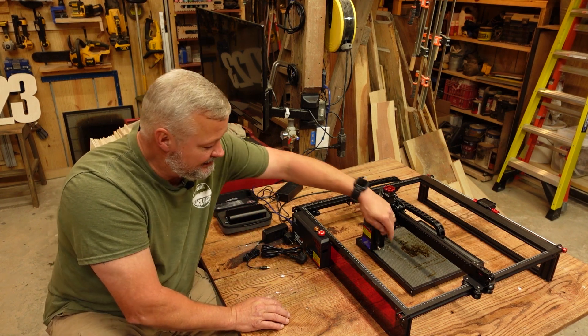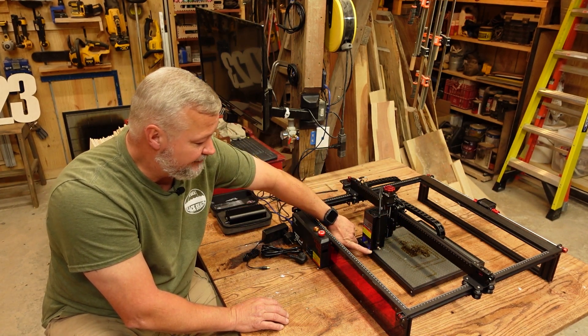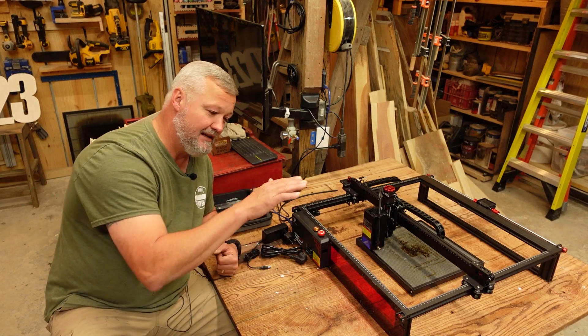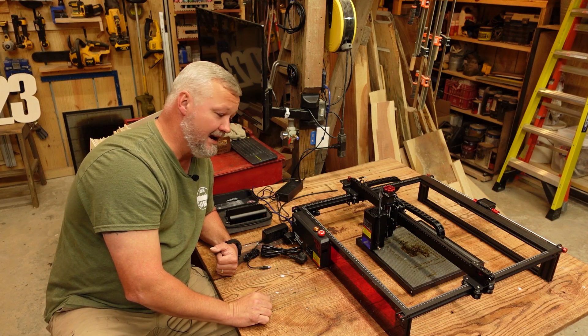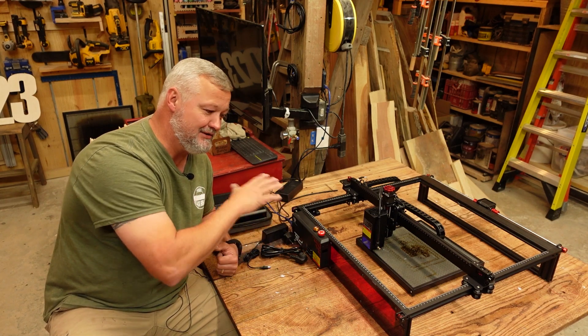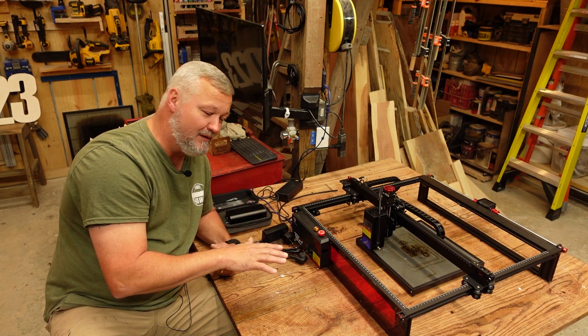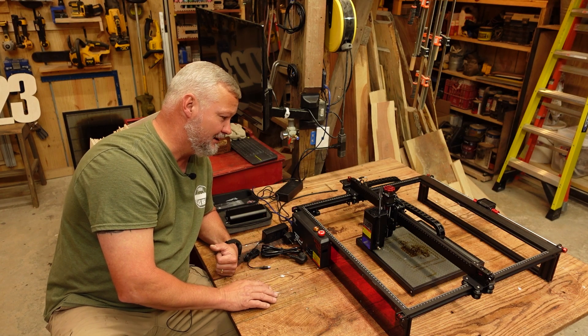With wood, sometimes plywood warps, so you may want to stick with the regular focus because this little bar back here sticks down a little further than the shield, and it can catch your material if you take too much off the focus. I learned that one the hard way — I was shoving material everywhere until I realized I was just bringing the focus down too far, causing the little sensor leg to strike the material.